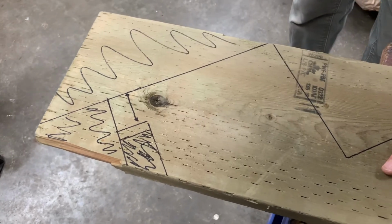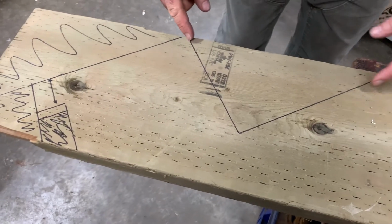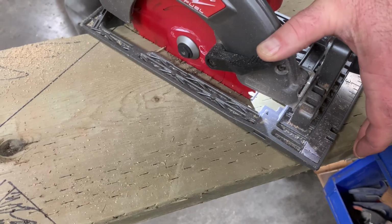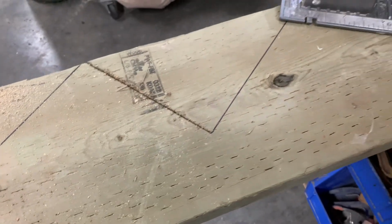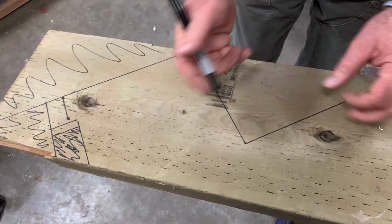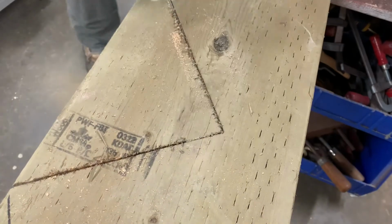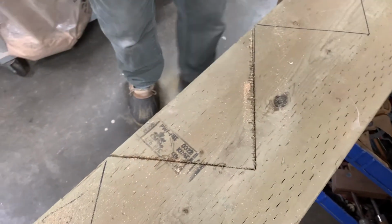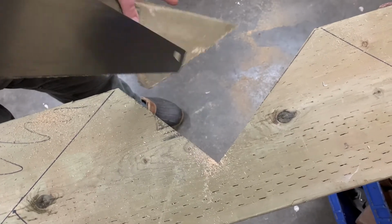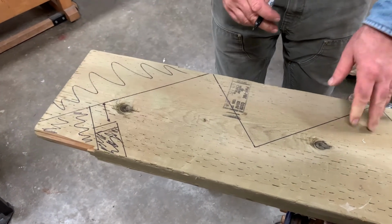Now, cutting these things is always a two-part process. The first part involves cutting with a circular saw as far as you can, but of course it's a circular blade, so where the cut might continue right into the corner up here, down deeper where the saw blade is kind of curving away, you're still going to have some wood there. So it's a combination of using a power saw and then using a hand saw to finish that cut in the corner in a perfectly plumb way. You'd use that technique here, and you'd use that technique here when you're making the notch.